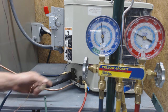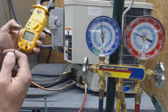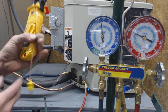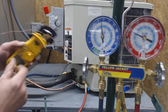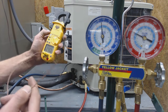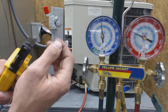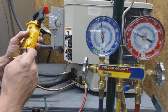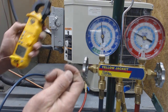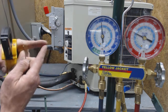So let's go ahead and find out what the temperature is on the liquid line. I use a multimeter with a temp probe to figure out the temperature. We turn that on — it says it's 70.3 degrees. This little piece of metal is a thermocouple — when you combine two dissimilar metals it's able to read the temperature. I just touched it so the temperature went up very rapidly. The temperature on this small probe tip is able to change very rapidly compared to a larger stick-type thermometer.